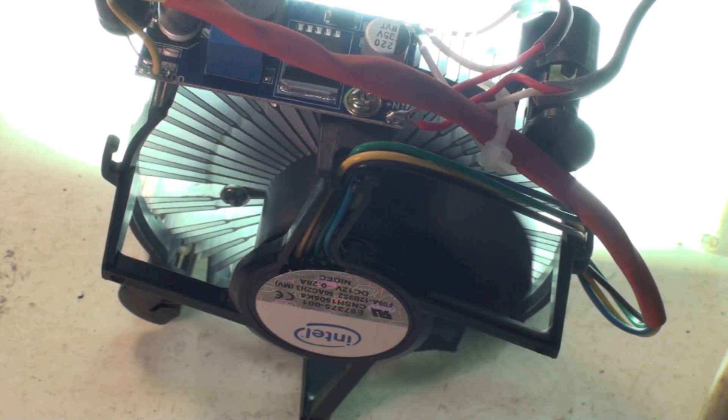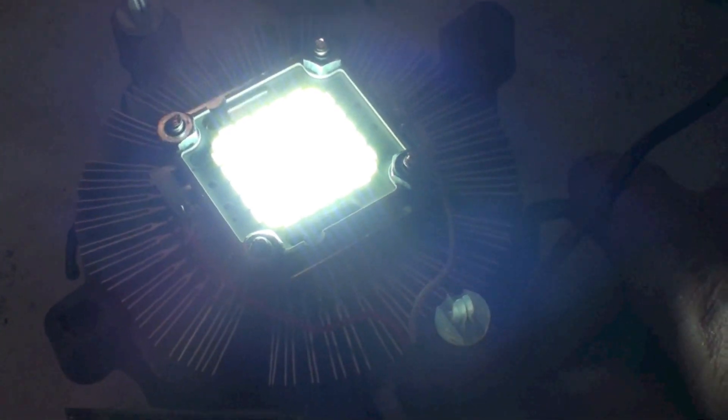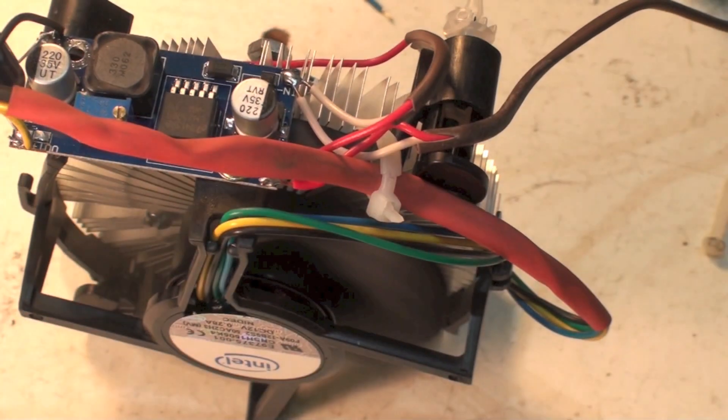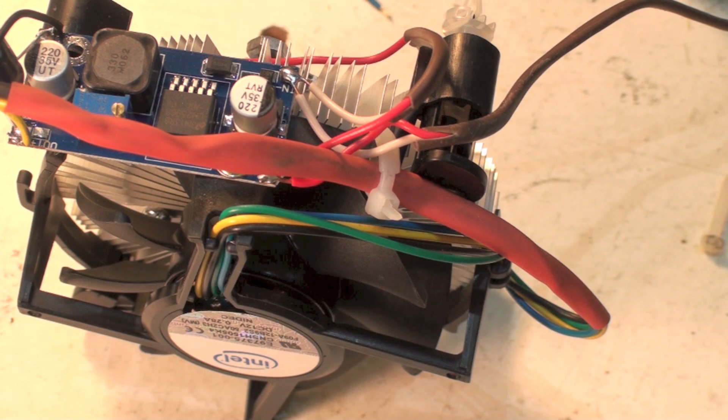It's enough to keep this LED cool — it never seems to get over about 80 or 90 degrees, maybe 100. It's putting out gobs of light and the fan is working. Total investment: about $7 for the light, $6–7 for the fan and heat sink, $1 for the buck converter module, and about 25 cents for the output capacitor. That makes a 100-watt LED light work pretty well.